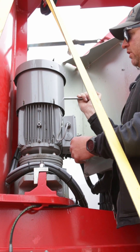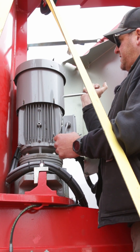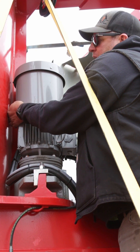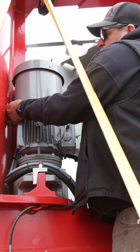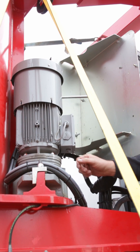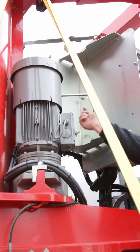To manually weather vane the crane here on the swing motor, we will raise up the front lever that releases the brake. We will press up on the tab, which should recess into the cutout on the back of the cover. That tab should hold in place back there — that tells us that we are indeed in weather vane.